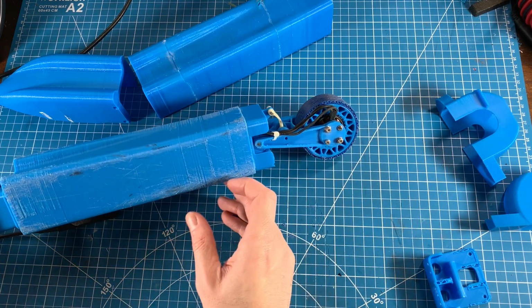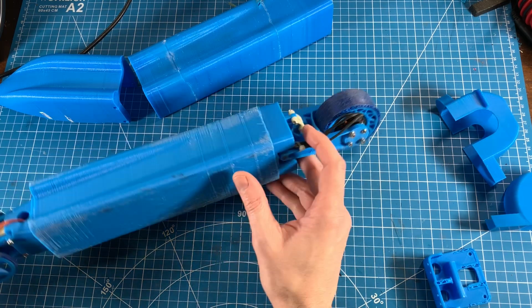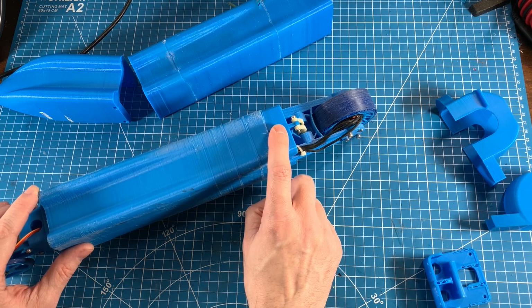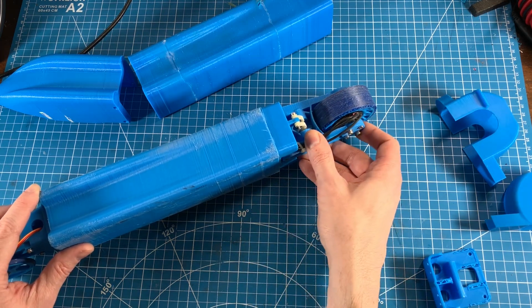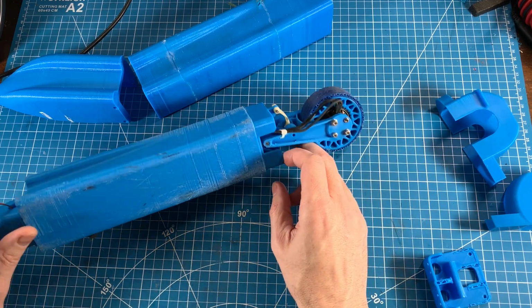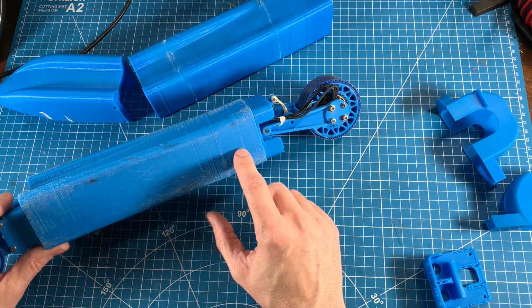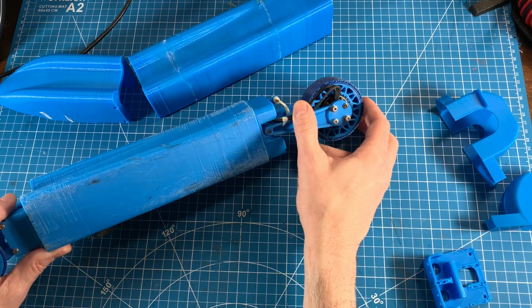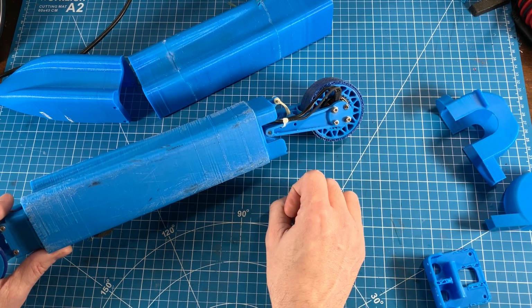The other thing that made this difficult was that I think I had too much rear spring rate. So the spring rate here needs to be much lower, but at the same time it has to be able to resist the torque of the motor from being able to flex it too much. So it's definitely a complicated thing. I think that's where I have to have the damper in there to be able to absorb that initial impact from acceleration while being able to have a lower spring rate.